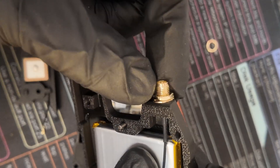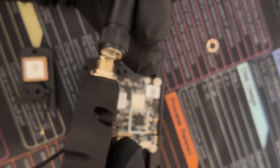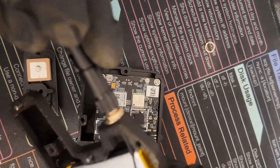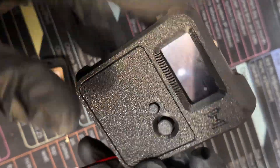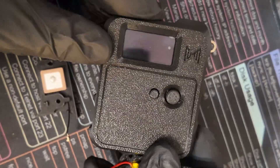Please make sure you tighten this nut all the way. You should have a decent amount of thread so the pin inside the male SMA connector fits into the female SMA connector. Make sure your LoRa radio is turned off — once the switch is down it means it's off. If you turn it on while there's no antenna plugged in, it could pretty much destroy the device. Please remember not to turn on your devices without an antenna plugged in.